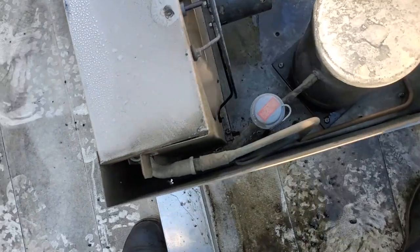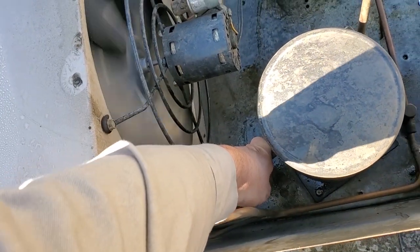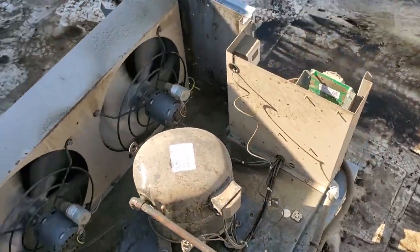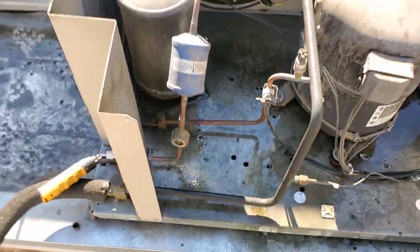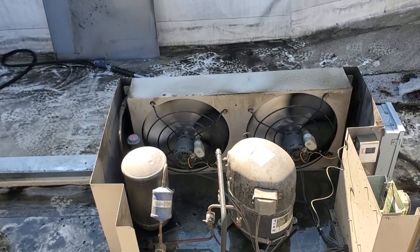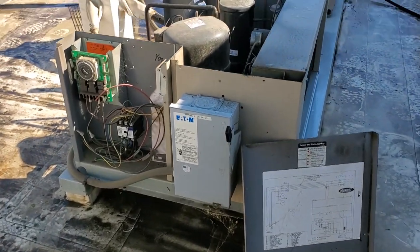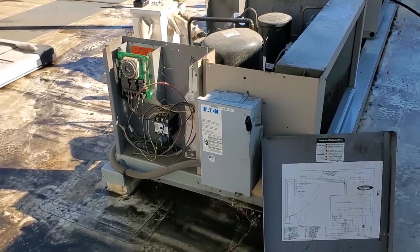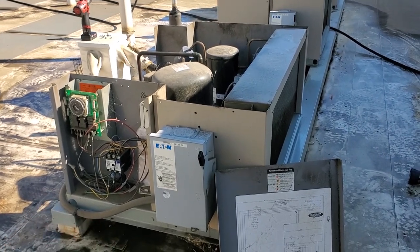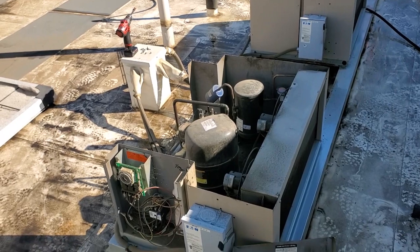My discharge line is warm, liquid drain is cold, liquid line is warm — so it's partially bypassing, not fully. We're still flashing. I'm not going to charge it with the water on; this is just helping me verify whether or not it was low on charge. This is a microchannel condenser. If you talk to Heatcraft, the manufacturer of this unit, they do give you a calculation on how to figure out the flooded charge, but when you call tech support, it's so confusing that they just tell you to put the maximum amount of refrigerant in the system. I'm going to have to do some research and will probably end up pumping the system down and filling up the receiver.